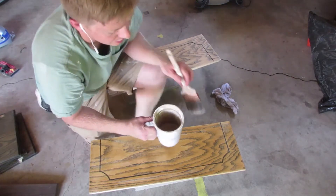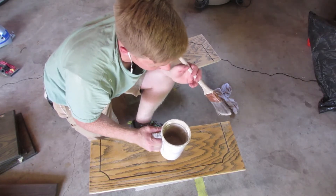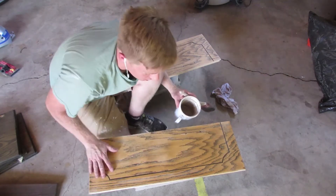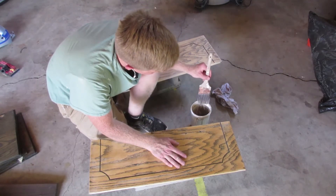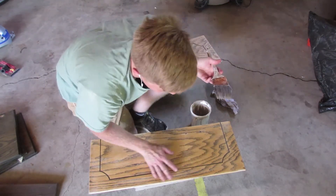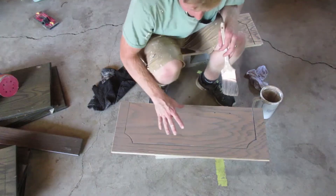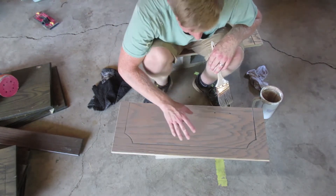What I have here is a gray paint mix - probably 75% water and 25% paint, really light and thin, so when it goes on it's just barely going to absorb. You want to put it on as light as you can but make sure you cover it all. This will give it a modern grayish look when you stain it. You can see the grain starting to pop through - when you do stain it, it'll really soak into the grain.